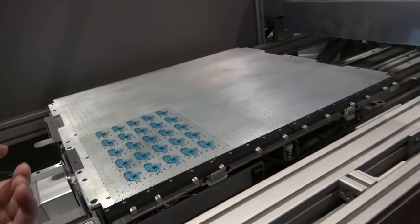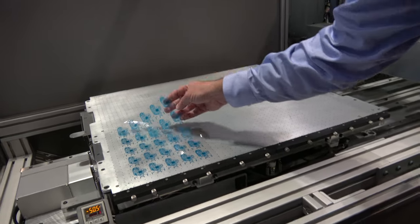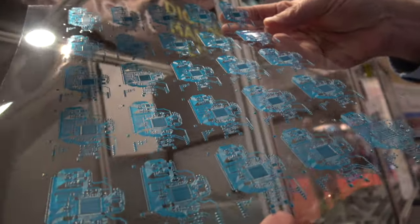That's it. So in a flexible circuit — is it possible to do that multiple times? You drop a conductive layer, a dielectric layer, maybe some decorative inks for marking, like your classic PCB silkscreen, and away you go.